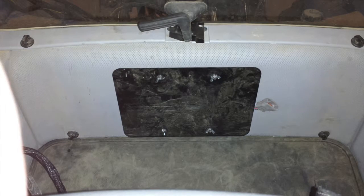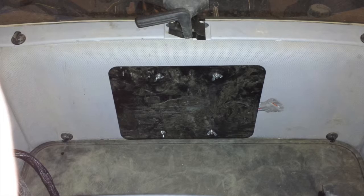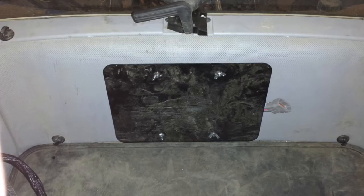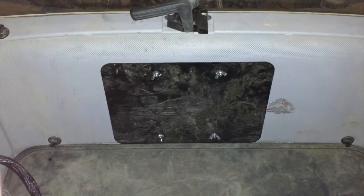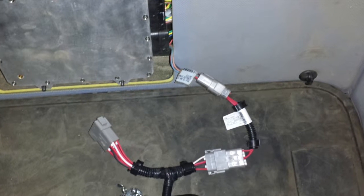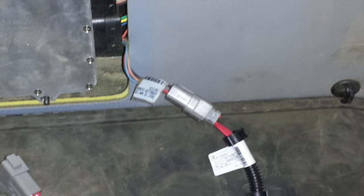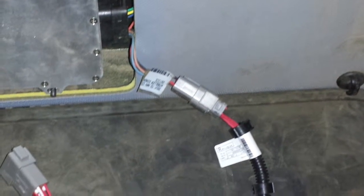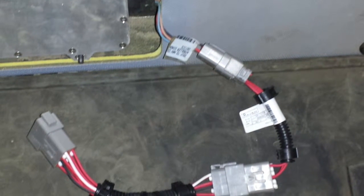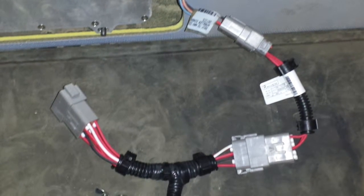The next step is going to be locating the navigation diagnostics port on your tractor. On front wheel assist tractors, and this is again on a newer style Magnum front wheel assist tractor, behind the seat there is a small cover panel. Once you remove the panel, there's a small diagnostic pin connection. Connect your universal GPS harness to that diagnostic plug. Again, there will be an empty or bare plug on that T-harness. Again, that's perfectly normal. Once you plug into your diagnostic port by your navigation controller, you are then able to route your harness back to the display harness.